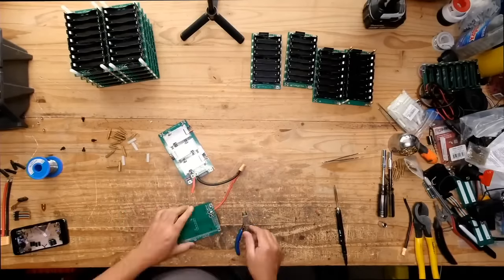So then you would have to get an external charger, which by the way, they make a 58.7 volts, I think that's what it is. It's a 14S charger, right? And you don't even have to put in an extra port. You just use the same XT90 connector and plug it in there. That battery is pretty safe. It's got BMSs in there, so it'll balance up when you're charging it, and if the voltage goes out of range or whatever, then it's safe.